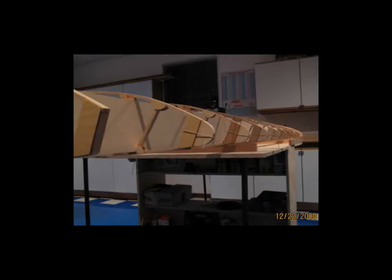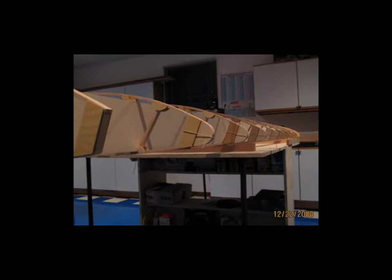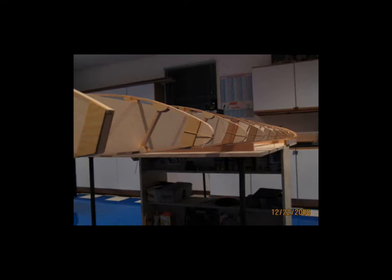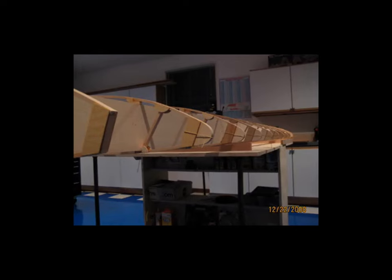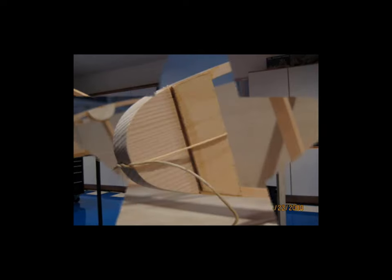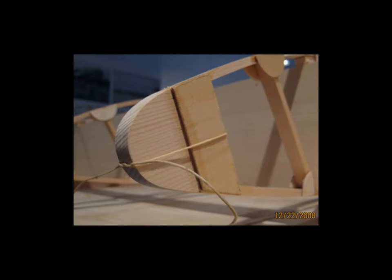I know. I said I'd do the wingtip next, but it makes more sense to do the leading edge prior to the wingtip, so I'm going to start here. Again, another mod that I did was the leading edge. Now, most people will run a continuous stick from one end of the wing to the other end to make up the leading edge, epoxy it to each rib,